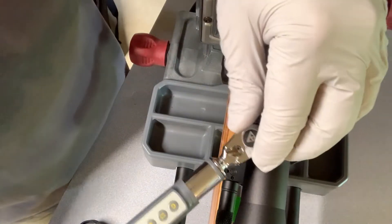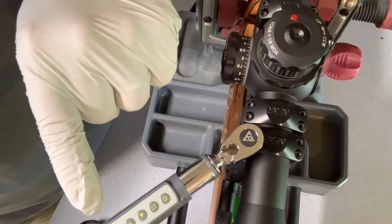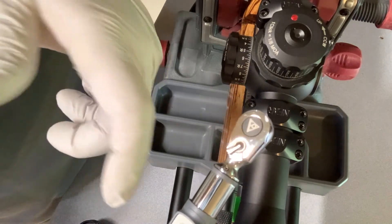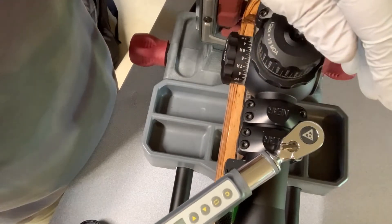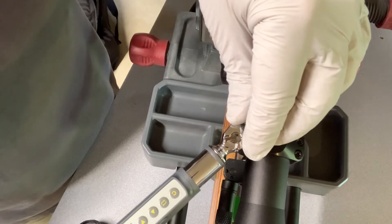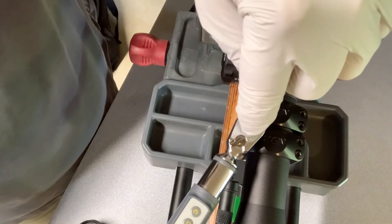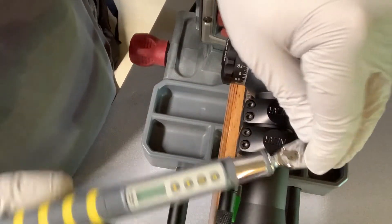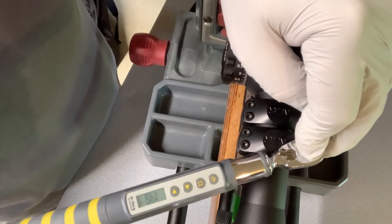I've got my Torx bit in and I'm going to make sure these ring sets are where they need to be. As I go — 8, 12, 15 — you can hear it beep. You can over-torque it; it's not going to stop you at 18 inch pounds, so listen carefully. I tend to put my finger on top of the center part to keep it square, and there are three little dots on each side as push points. I set it up and push with my finger there — there's the beep.